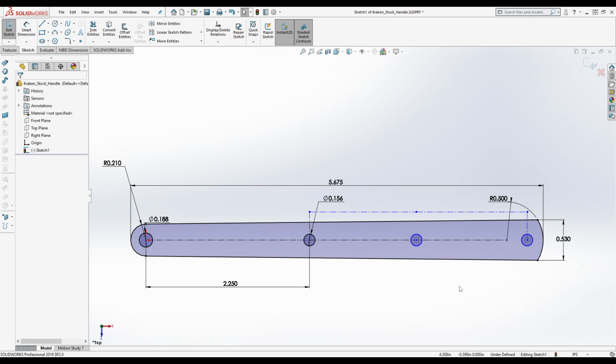The reality is the best way to go about getting the Zen pin location, I think, is to model the blade using a scan, a high-resolution scan. You can often get very, very close, especially with a blade shaped like this. You can get very, very close to just guesstimating it. But then you would make an assembly and you would start positioning the handles so that you can get the handle gap approximately what you want. And what you will find is that Zen pin location, that spacing is probably just like the rest of this. It's going to be a number that makes sense, right?